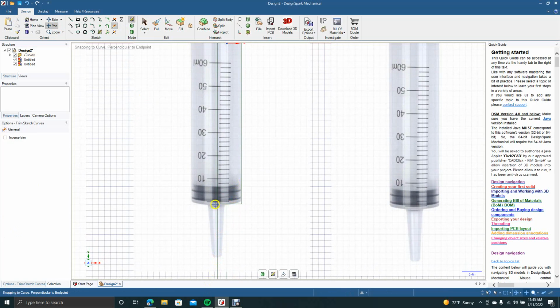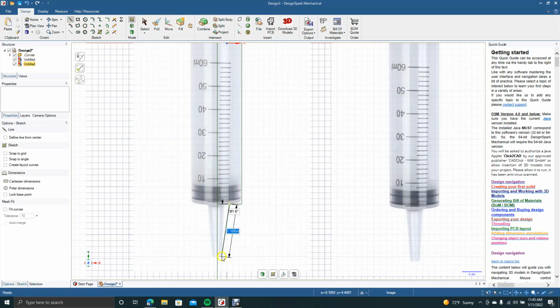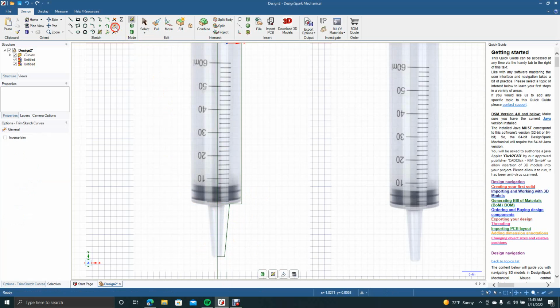We're going to put in our angled spout. We'll click there. We're going to come to the center point there. And then we're going to drag down 1.105, and the degree angle is 84.7. So we'll click there. Then we're going to come over there, and then we're going to end our sketch there. I need this spout to be big enough so I can shell the stuff. So if we're going to shell it, we may just add our stuff onto it.